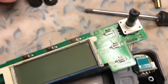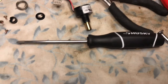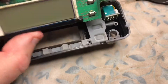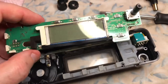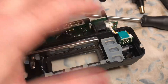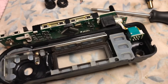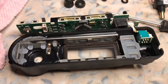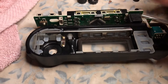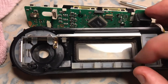There's also a plastic inner grommet that goes on the lower control knob when it slips in — that pops out from the front, so watch for that. Once you desolder the four pins for the control, you can actually pull it out. The way I pushed it out was from the lower knob in the front and the actual VFO knob to snap this out.